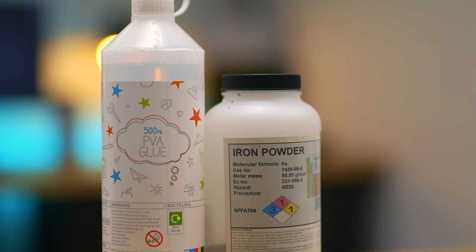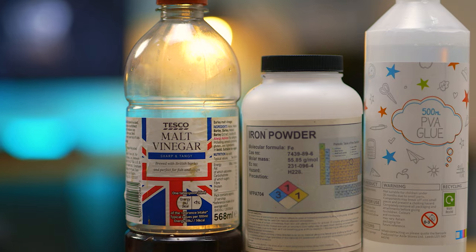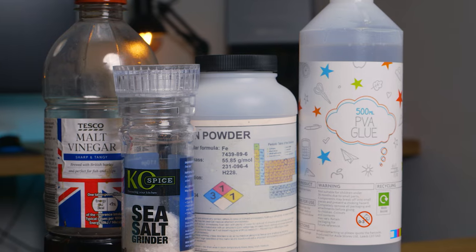Your main ingredient for this is iron powder. What we want to do is mix that into a medium to get it stuck on to the test piece. We're going to try a couple of different ways: cheap PVA glue, matte varnish (which sometimes contains solvents like ammonia), vinegar (which helps iron rust), salt, and finally vinegar and salt together to see if that aggravates it even more.